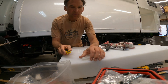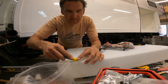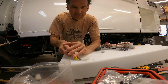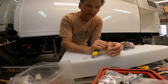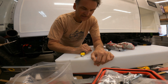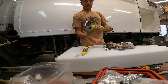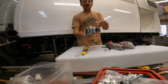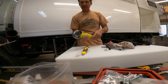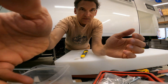What do you do when a spin weld fitting doesn't go well? That's what happened here — one spin weld fitting out of the roughly dozen that I put on did not seal up well. It got a little wobbly. This is one of the challenges with the half-inch ones because my driver is on an angle grinder, and because of the fitting attachment I couldn't easily fit it into my router without modifying something.